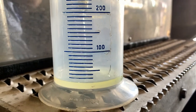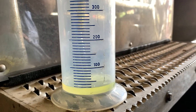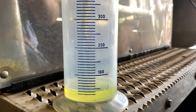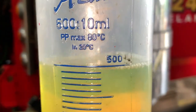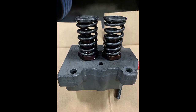Here we are measuring injector return flow. When we finished this test we had under 100 milliliters — about 80 to 90 mL — so our injectors, connector connections, and injectors themselves were in good shape. On our last check, pump head return flow, we weren't even through with the test and we were well over 500 mL — the pump head failed. We checked the cam lobes; they looked good, the bores looked good, and we were ready to put a new head on. Open up the new pump head, transfer the old springs — they snap onto the pumping chambers — the pistons will already be in it; just bolt the actuator housing on and install it into the pump bore.